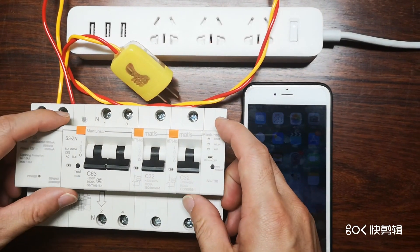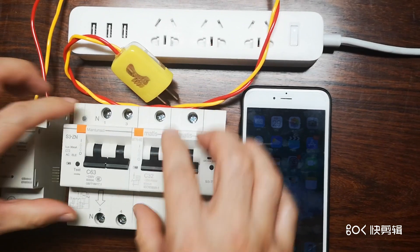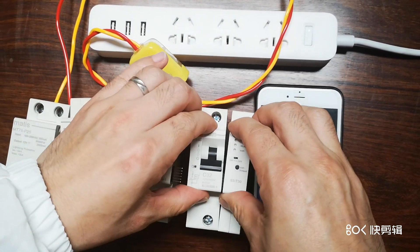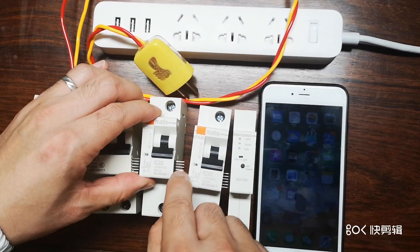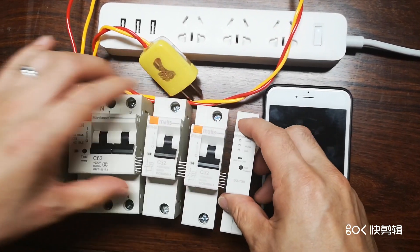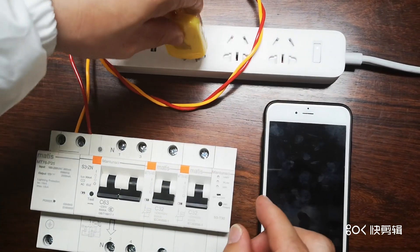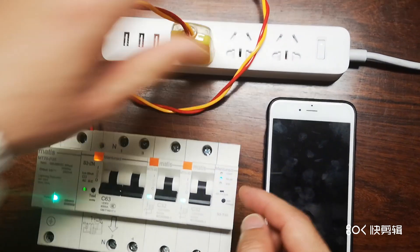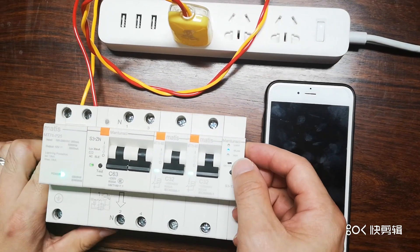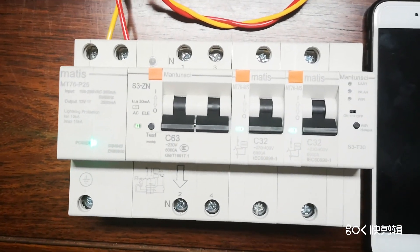Here is our MT-S3 smart metering breaker. Each of them gets connected with six pins — power supply and also communication. We are going to connect all of them and then firstly get the power supplied, because this communication power module requires some time to do the configuration.